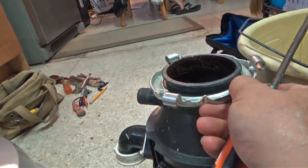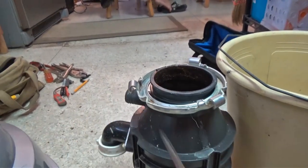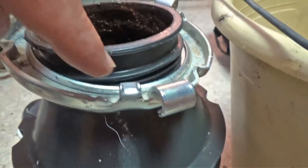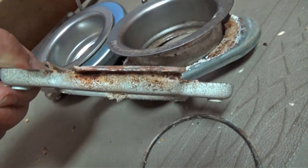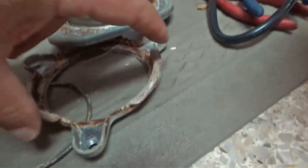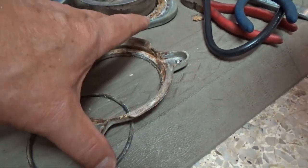To remove the old one it was under the sink like this — you push the flathead screwdriver here and you turn it clockwise. That would unlock it from what's hanging. See these three little clips — they clip on to this ring. See how this ring is at an angle? Clockwise looking from the bottom to tighten, counterclockwise from the bottom to undo.